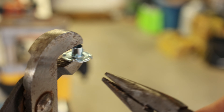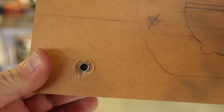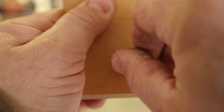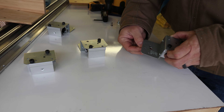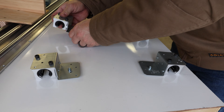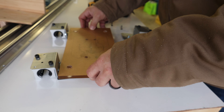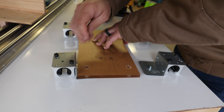The acrylic was surprisingly easy to work with. The nice thing about it is it has a protective paper film attached to it, so we can actually draw on it — just like working with real wood — to mark all of our holes and how much we needed to cut off. I kept a couple of pieces for later use, then ran it through my table saw. This was actually the first chance I got to use my crosscut sled, and it worked beautifully. Super happy with the tie-downs keeping my fingers away — it cuts like butter.